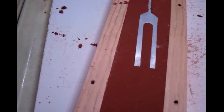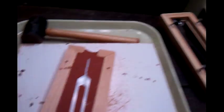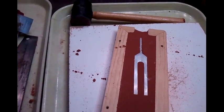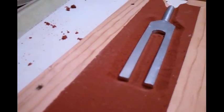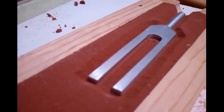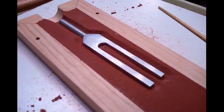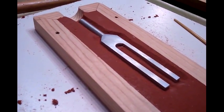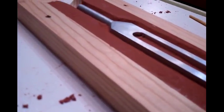You have to dig it out enough so it will fall out of there, and then you put the top on. Pack it full of sand and take it out — you'll see as I go. There, I got it all cleaned out — you can see what I mean. Halfway down all the way around it, because there's no way you're going to be able to push that down into the sand. So you lay it down first, put the frame around it, pack the sand up really tight, scrape it flat, and flip it over to this spot and then excavate it down halfway.